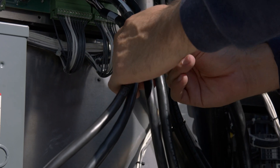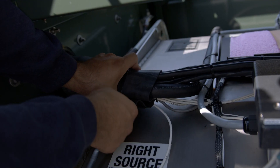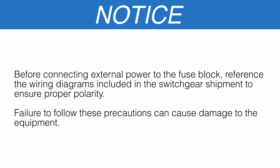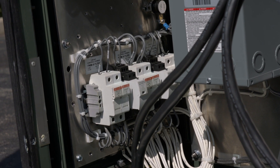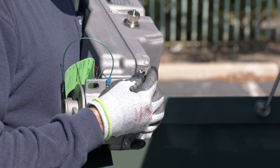Once all connections are made, straighten the cables within the low voltage compartment and bundle them neatly by installing tie wraps. Gather and twist the butyl tubing around the cable bundle and apply tie wraps along the length of the excess butyl tubing. Before connecting external power to the fuse block, reference the wiring diagrams included in the switchgear shipment to ensure proper polarity. Failure to follow these precautions can cause damage to the equipment. To connect external control power, connect the line and neutral to the fuse block. Do not ground the low voltage enclosure to the external control power building grounding; PVC, non-metallic seal tight, or other connection methods should be used to avoid bonding the LVE enclosure to the building ground when connecting external control power.